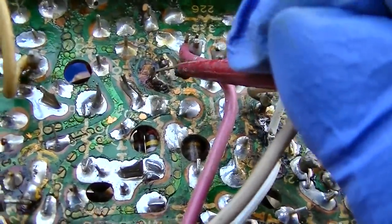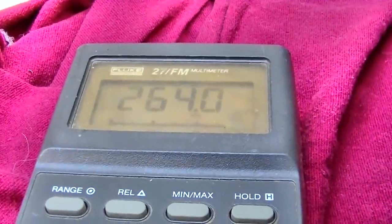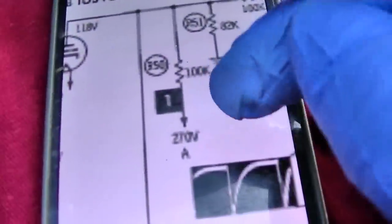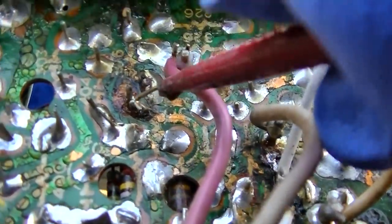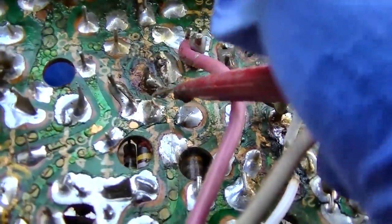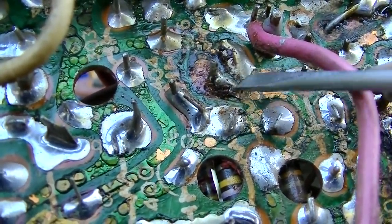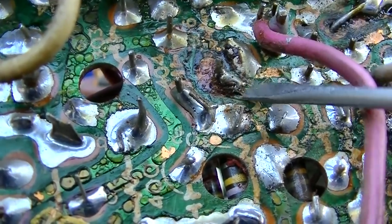...this crappy-looking thing — we have 264 volts. So it looks like we've got a broken solder joint right there. Yeah, 270 volts — so it's going to be high because it's not loaded. This is probably our 100k resistor. So the fault is right here. It looks like someone had been working on it — oh yeah, it's broken. The freaking trace is broken.